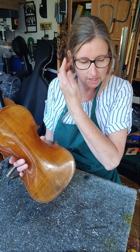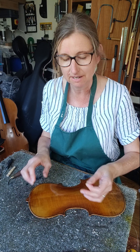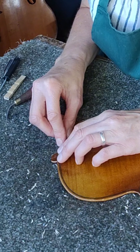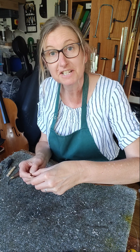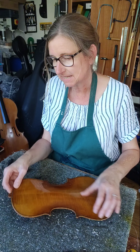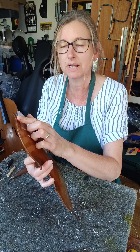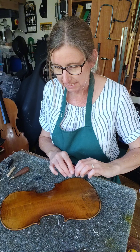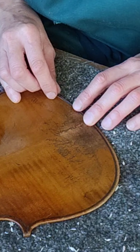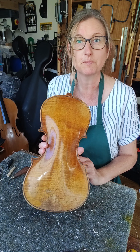That's cleaned up quite nicely. I've got a couple of bits of purfling here that I've cut to length. I'm hoping I won't need to bend them using my bending iron — just bend them a little bit and get them in. That actually fits in there pretty well. I've already cut it to length to save time, and it fits in there. It's standing proud at the moment, so I shall scrape that down to match the existing surface. I've cut my other piece of purfling to fit and I can bend that into position as well. So we have the two new bits of purfling in position — now I need to glue it.